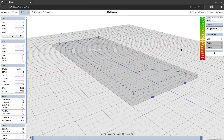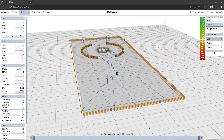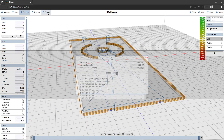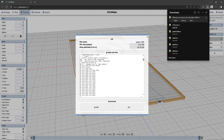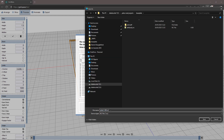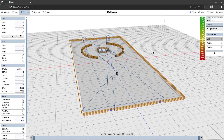Then I'm going to select only the milling operations, tell it to slice and preview — that should be all the bits I want for the four millimeter end mill. Export that exactly the same way. In reality that would probably take about 20 minutes on the CNC machine. Save as, go to the same place, call that 'mills only'. That should be it.